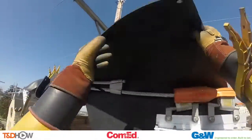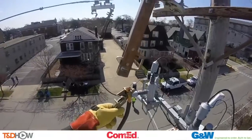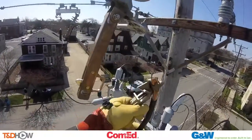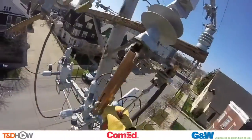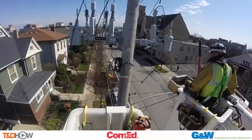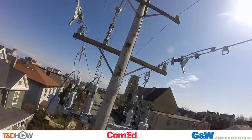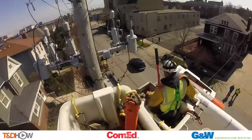And then reaching up to open what he refers to as a door and pulling rubber off — removing rubber. Notice how the linemen are in constant communication with each other as to what's going on. Now we're going to see the installation of tabs onto some switches here, and this will be done on all three phases. Once done with all of the tabs on this side of the distribution pole, we're going to switch over to the other side. You hear them confirming to each other that all three of the switches are open.